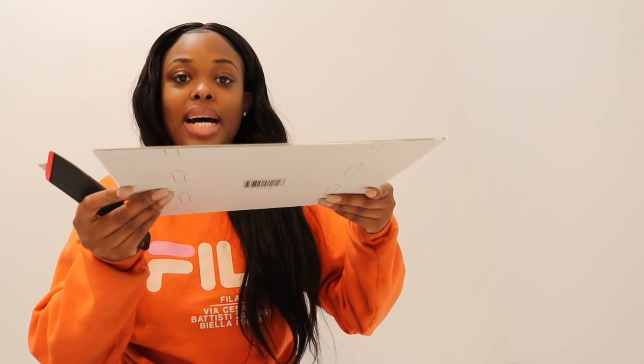I actually want you guys to scratch what I said in the beginning, because I just realized the 12x12 square doesn't look as white as the 12x24 square. So I'm going to put the 12x12s back in the box and take them back. But I am going to use one as a reference to basically carve out one of the 12x24s into two 12x12s. So I'm going to need my box cutter — I'll just place the 12x12 tile on top of the 12x24 tile and basically slice it and then break it.